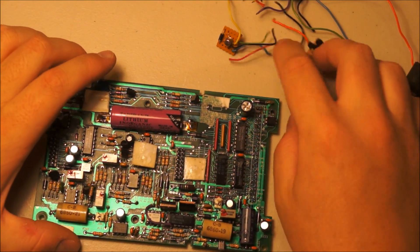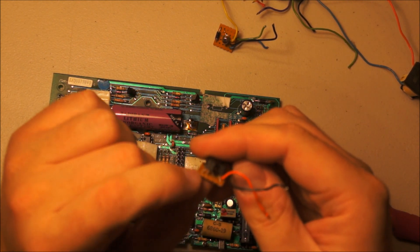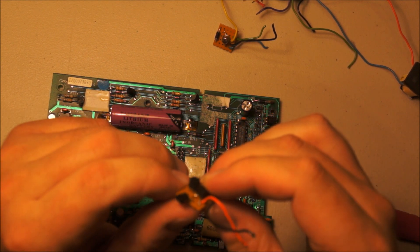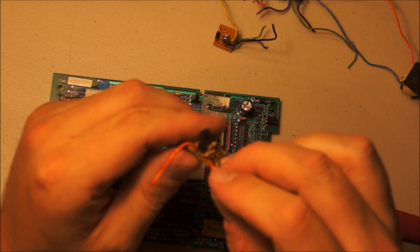Anyways, here are all of the bodge boards. You've got three little ones. This is a 2N3904, there's a VN2222 — so that's a 2N2222 — there's a 2N3906. These are all just ridiculously common off the shelf transistors.